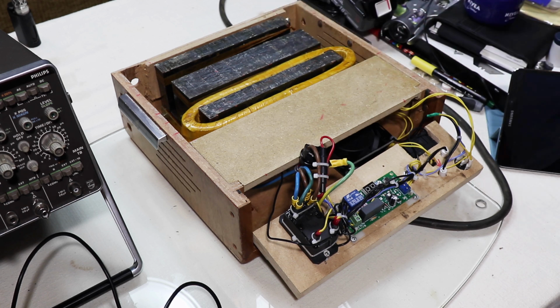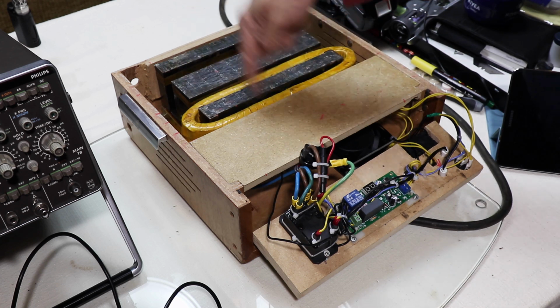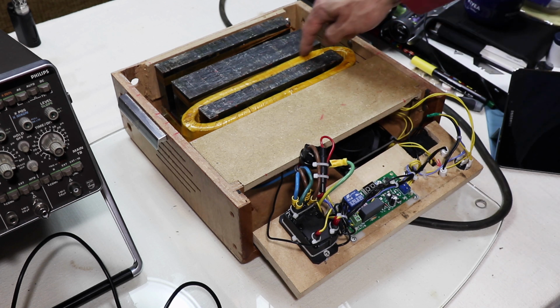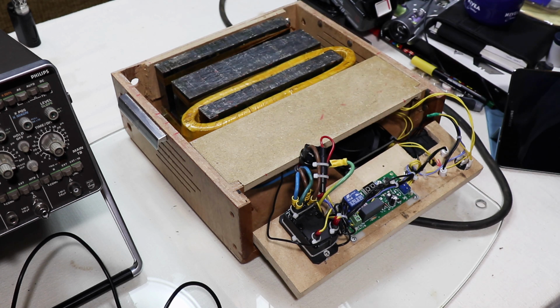It's hugely heavy. It's over 10 kilos, and it's made up of laminated iron or steel sheet. So there's striations going down here across the whole yoke. It's lots of little plates that have been squished together and glued in place. And you can see here there's this primary coil there. It's wrapped in tape, and then that's been painted in some kind of varnish glue to hold it all together. And this is really more or less half of a transformer, so you can see this as being the yoke of the transformer. Here's the primary coil, and you could wind a secondary on there.